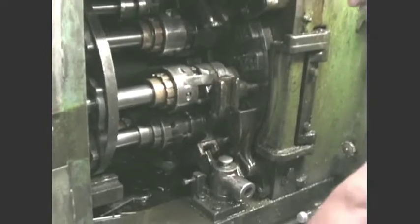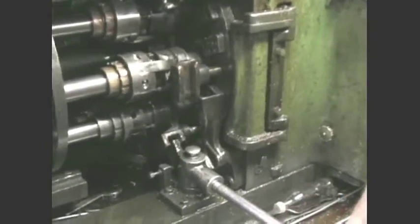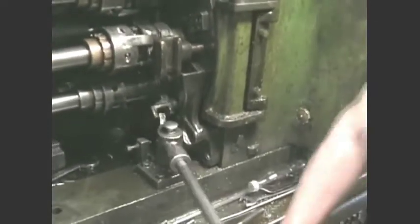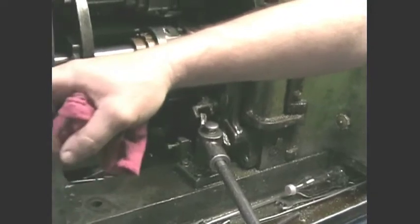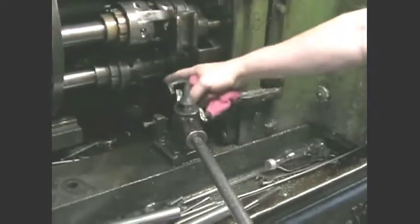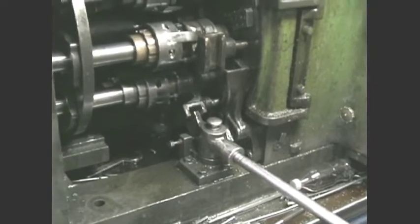Thank you very much, Michael. I haven't got any stock in it — this is for the collets, our parts loaded. Unchuck it, take out the butt end, ram a new bar in right down through, bang it in there, chuck it up. You do that eight times, then it'll run by itself.